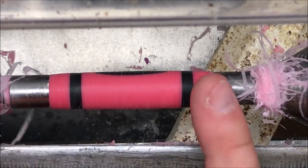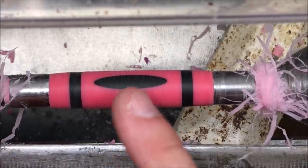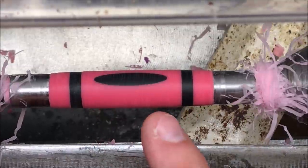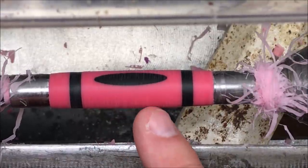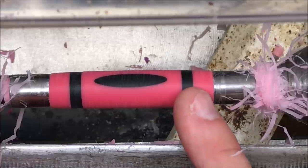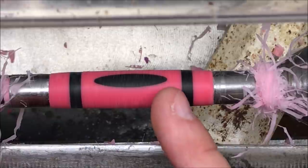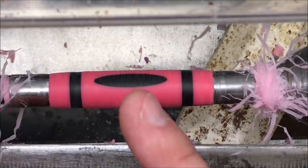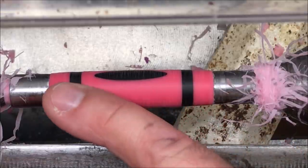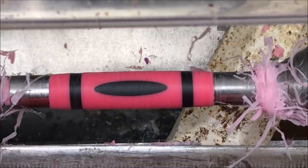This end feels really good, but we'll just run the entire pen. I've got a little bit of a hump right there, and I think that might be caused by — I'm guessing this is 3D printed and it's a filled 3D printed mold. Not 100% sure on that, but if that is the case, obviously when you go from material A to material B, sometimes the hardness of the material changes and you'll get a concave or a little convex section. So we're going to be real careful and just take that little hump off. Let's loosen up and get everything fixed and ready to go.